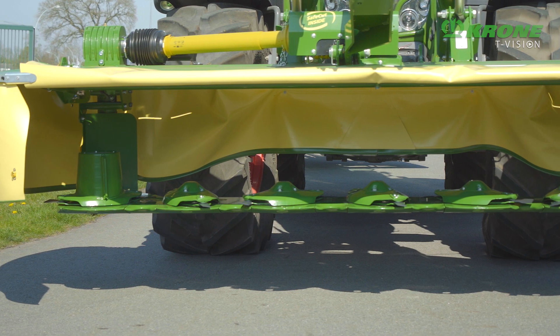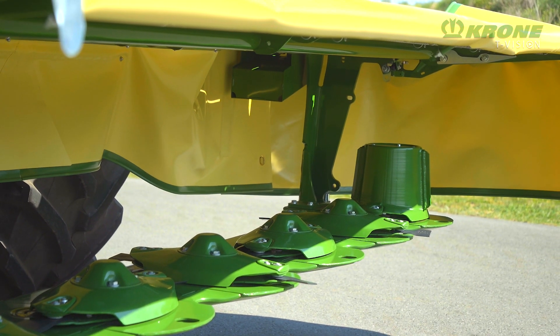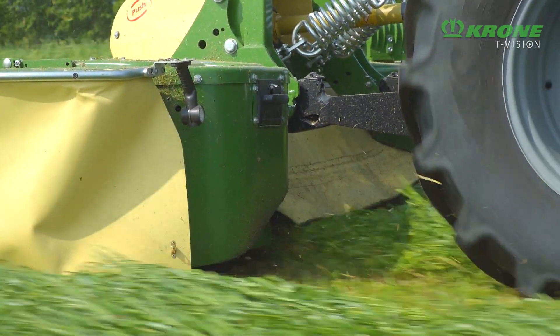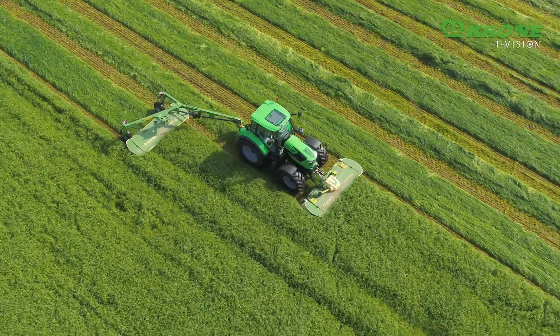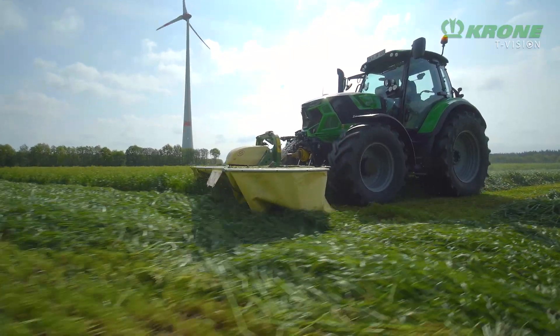These light and compact mowers have no top hats but spread the material across the machine width. The standard front mowers from Krone have top hats which swath the material so the tractor can straddle it. As an option, these models have a tine or roller conditioner that speeds the drying process.